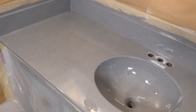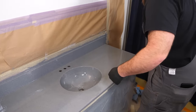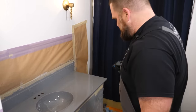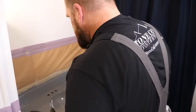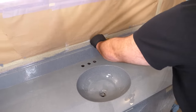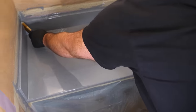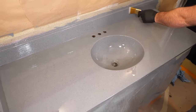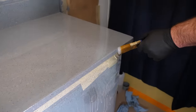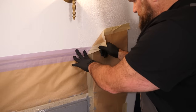When using heat to remove the air on small vanities, between torching let the epoxy cool a minute or two to keep from overheating. Wow, that's looking good! Where I'd look for some surface tension would be around this sink lip — I don't see it, it looks really good. On your edges you might catch some, but they're looking really well. Running the lights from above over the project, it's almost perfectly level already, and it's been 10 minutes. I'm going to wet my brush one more time and rub my backsplash again — it's looking really good, I'm very happy with how it's looking.